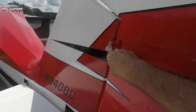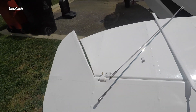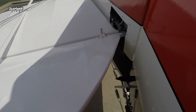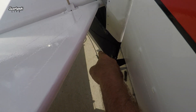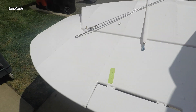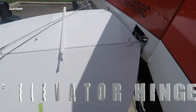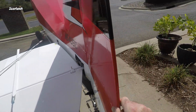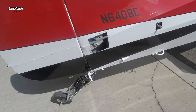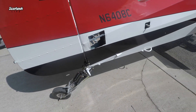Flying wire will come from the top of the rudder post to this outer hinge, and the same on the bottom. There's a bow tie down there with a quarter inch hole that goes to the bottom of the rudder hinge here. My rudder is installed — I did a permanent installation on that. I think I'll be okay for the trip to the airport. Everything's been tensioned and everything's working really well there.